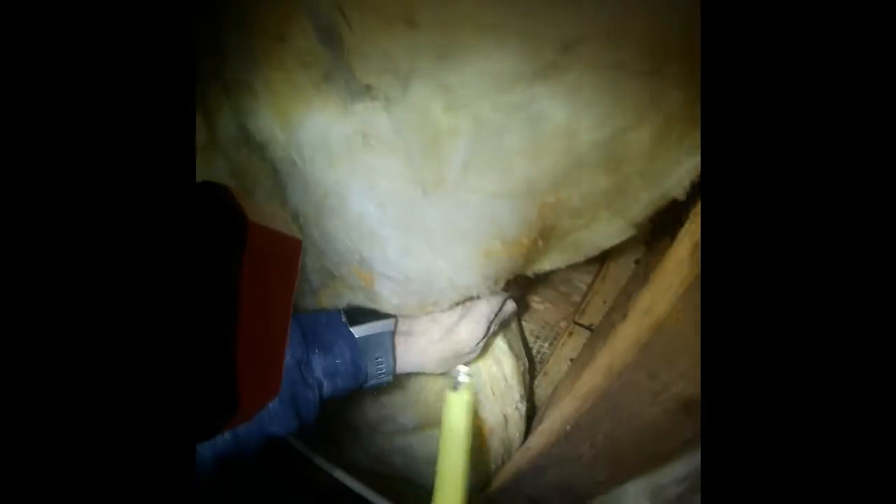We have engineered beams here — these are like I-beams but made out of wood, and they are two-by-ten. There's a bunch of stuff in the crawl space that will have to be removed. The inspection report mentioned mold and fungal growth. The way to handle that is to remove the insulation, have the property sprayed with the correct chemical by an EPA-certified applicator, then put the insulation back in. We cannot reuse the old insulation — it just falls apart when it comes out, so dispose of it and put all new in.